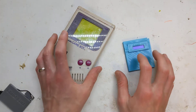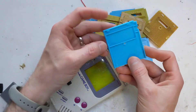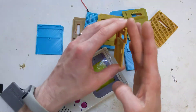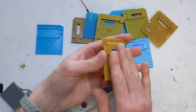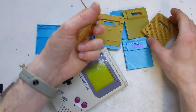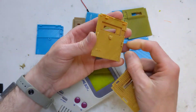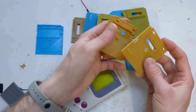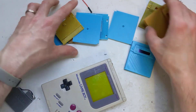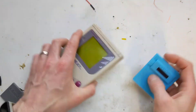Doing this case just turned out to be a major headache. The back side of the case — it's got the screen, got a switch here — that was quite easy to do. It was just this top piece, because normally I'd print it face down, but you'd get a horrible texture on the visible part. So I basically had this massive raft to sit it on, which took a long time, and when you pull it off sometimes it pulls off little bits. It was a major pain as you can see — went through a lot of iterations, finally ended up on this one. There's probably only half the 3D printed waste shown but I'm quite happy with how it turned out.